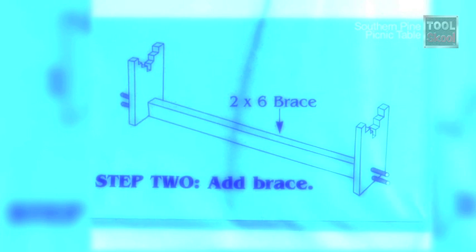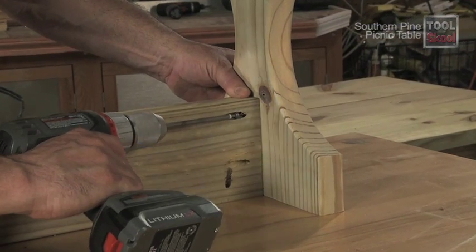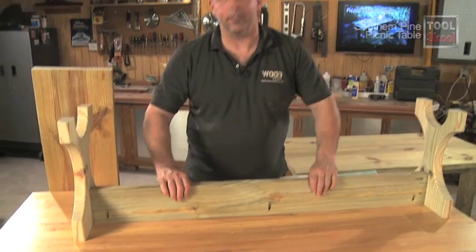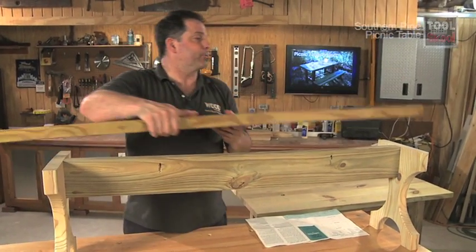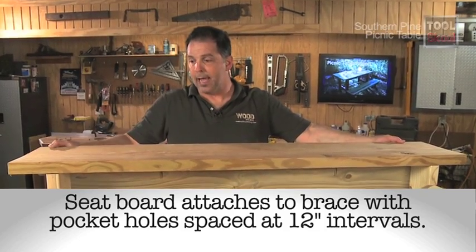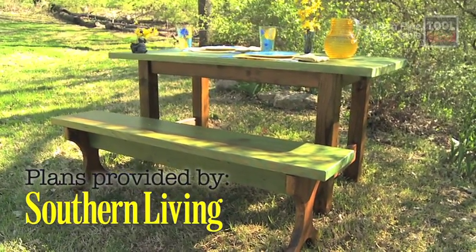The two ends of the bench are held together by a 48-inch long support board. I've drilled pocket holes at each end to tie it into the bench ends, but you could just as easily install screws from the other side directly into the support board. Our last step is to flip over the assembly and attach our seat board — a 2x12 cut to 59.5 inches long, the same length as the table. Interestingly, if you can find a board with a good warp in it, it actually works better as a seat.